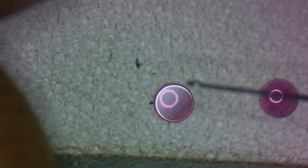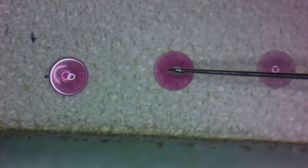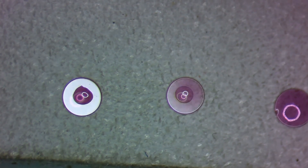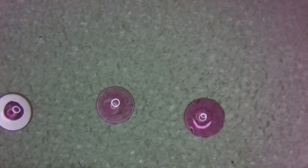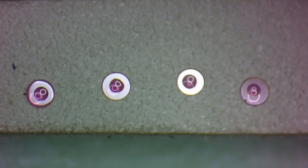Here's one jewel oiled. Here's the second jewel. The third jewel. Because I'm able to insert the oiler into the pot in the same way every time, I'm pulling the same amount of oil out of the pot each time. When you look at the oil spots on these jewels, you'll notice that they are as close to being the exact same size and the same amount as you could possibly get.